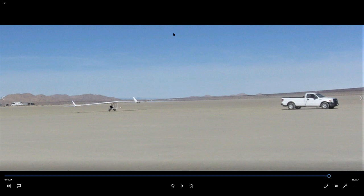Bob ran alongside me, I ran, and we started out in a walk and worked up to a run, and actually got to the point where the glider lifted my full weight, and my feet might have been an inch or so off the ground. We're very happy that we've now identified the correct CG location for my hook-in, and it's as predicted, so that when we go do future foot launch flights, we know precisely where to hook in and that it will work fine.